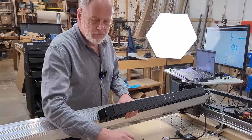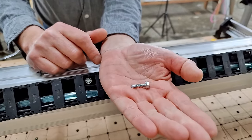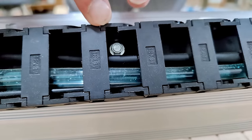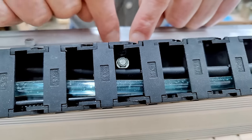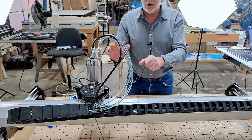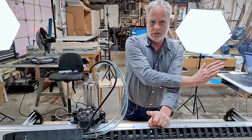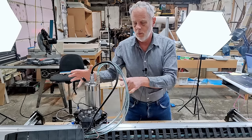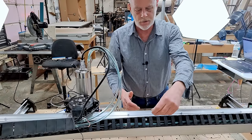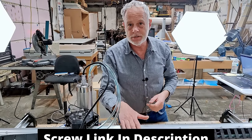I may come up with a bracket to hold it, but we're just going to move the carriage all the way down and make sure the drag chain doesn't bind anywhere. The way I secured the drag chain is simple: a self-drilling screw from my toolbox, run down into the drag chain and right into the frame of the Longmill, making it very secure. Just make sure you know where the drag chain is going to lift when it's all the way over, so you don't screw it in at a point where it will try to lift up.